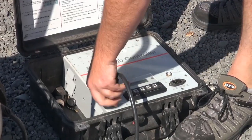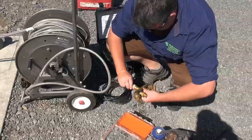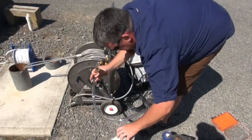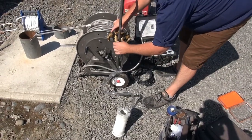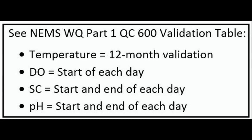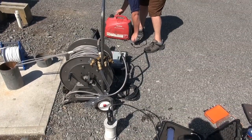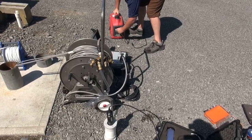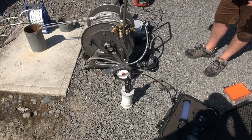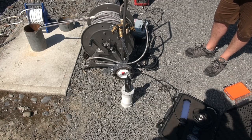Make sure your fitting is nice and clean. Make sure your flow cell and your yield meter are set up. Get a nice laminar flow coming out of it. Then initialise the system. There are lots of different pumps you can use to do this — there are MP1s, 12 volt pumps that are adjustable. The key is whether you can get it in the screen and adjust the flow rate.